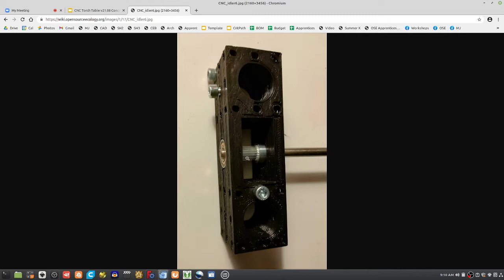It's a 15 millimeter belt, but we just use the pulley that we use on the motor. That's one way to do it. We can also just 3D print a part here, which just goes on a shaft. And how do you locate this? Well, it's press fit, so if this rubs against the sides, you're good. If the bearings are right next to it, the press fit of the bearings locates the idler if the bearings are touching against this pulley here. So this is self-locating. Don't even need set screws or anything.